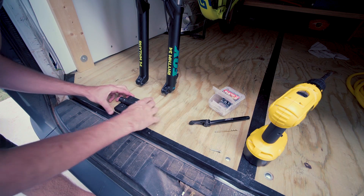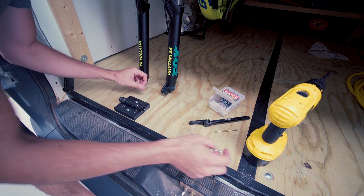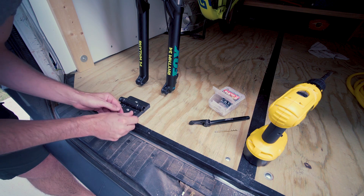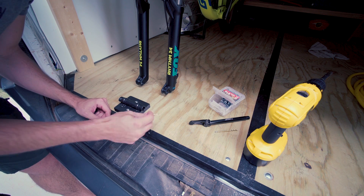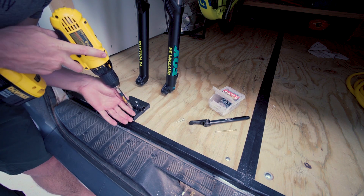On this one I'm actually going to take all of these screws out that I put in earlier. Those were only like three quarter inch screws, so they were just going in here. I actually wanted to go down into this wood as well for a little more security. So I'm going to take these out and replace them all with an inch and a quarter screw so it grabs a little more material.